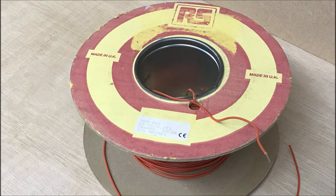What happens if you try and run DCC through lightweight wire? Imagine a current trying to go down a wire — it's like a lot of people running down a corridor and trying to get through a door. When they get to the door they can't all go through at once, so you get a slowdown of the flow. In electrical terms that's called resistance. You want the least resistance possible, so if you've got a higher current — more people — you need a slightly bigger corridor. That's why you go for 24/0.2 as opposed to 16/0.2.